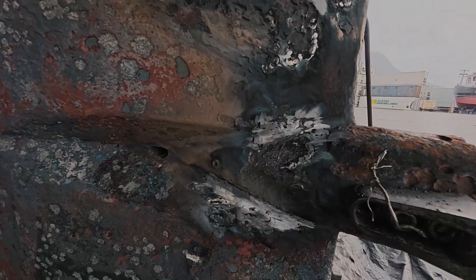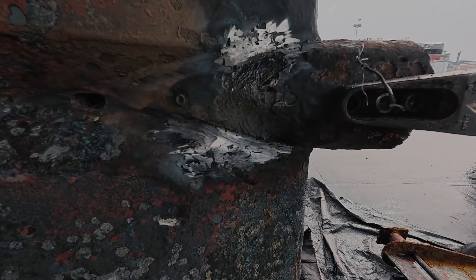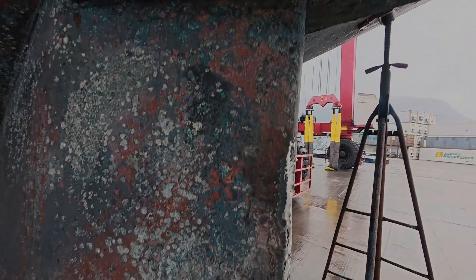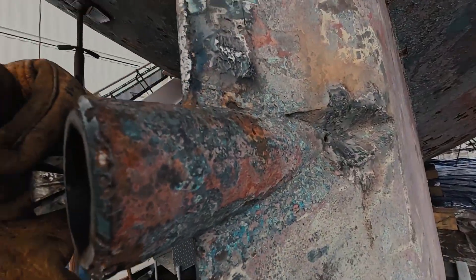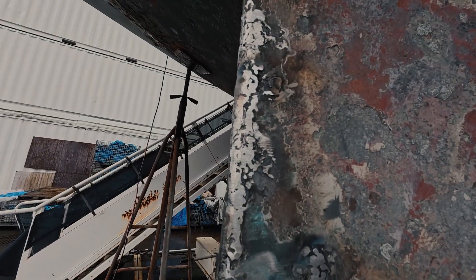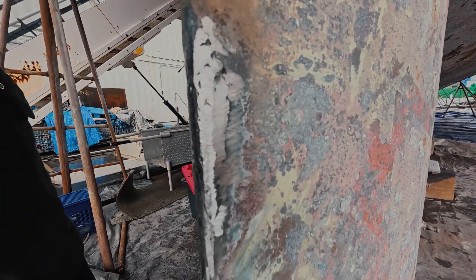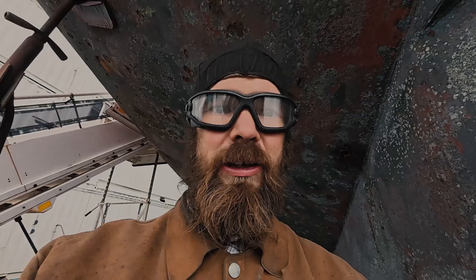Here's a little view of after a bit of welding — got most of the metal filled back in. It's not real pretty, but you've got to keep in perspective that the entire hull is pretty covered in electrolysis divots. If I get stuck trying to get it perfect, I'll never get her back in the water. So this might be good enough for now — we'll see. Might fair it out with epoxy, but for now the structure is back in and I'm gonna go put some things away before they get rained on.